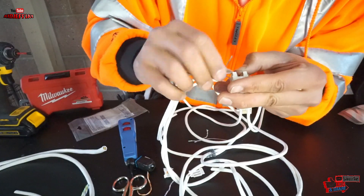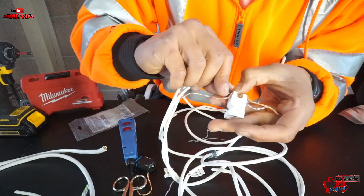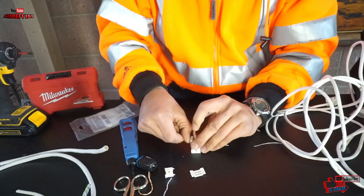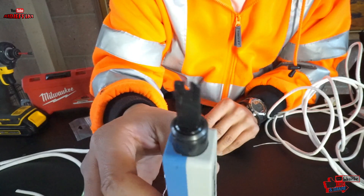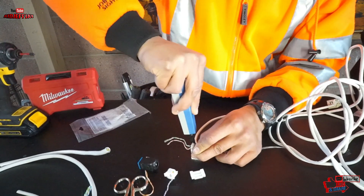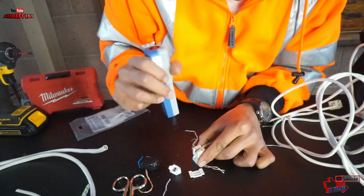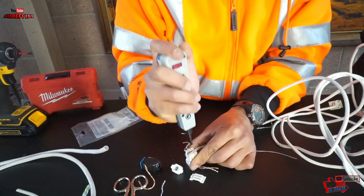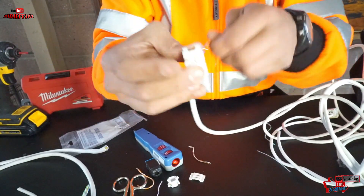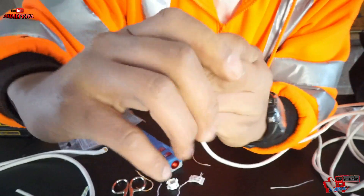Now you just look for the colors. Don't worry, just be patient with it. Once we have all the colors in place, we just punch it and tighten them up. Remember the blade — the little shiny part of the blade goes to the outside and you just push it down. Then you do it to the other side and flip the little blade. There you go — twist them off. Bring it to the center. The second mount jack is done. Grab the little cap and push it in place. Second jack officially finished.